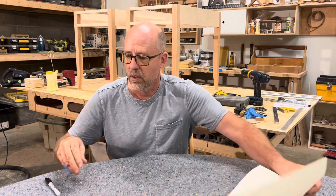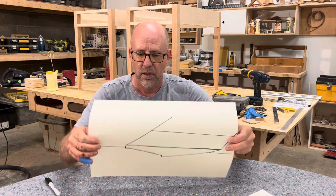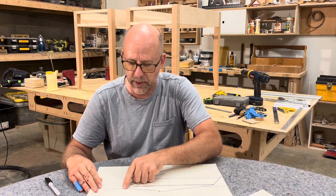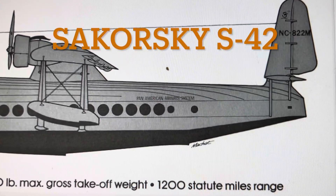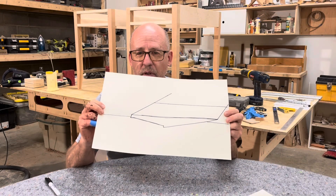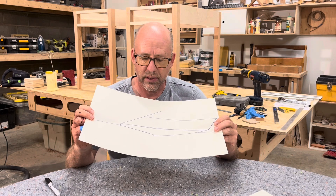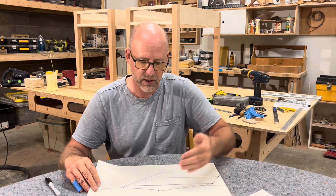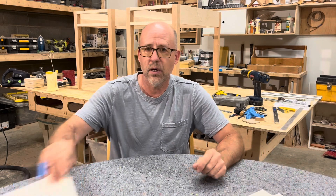This part is underwater and I don't know how to ventilate it. So I have two options going forward. Option one: I saw a seaplane that had a shape like this, but with a little downward deflector on the back step. I could try that - it would eliminate the downward suction. The problem is whether I can ventilate that surface, since it's completely underwater.